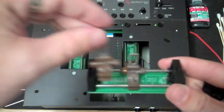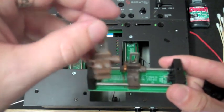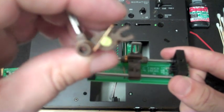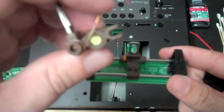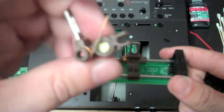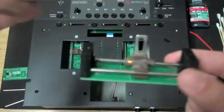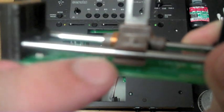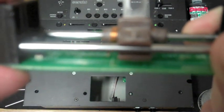This is your crossfader. Moves back and forth, left to right. Also, you'll notice this little copper spring on it. That's called the torsion bar. And this is how we can increase or decrease the drag the fader has on the rails by its position. As you see, it's currently along the bottom of the rail for a nice drag.